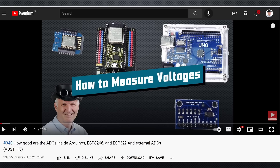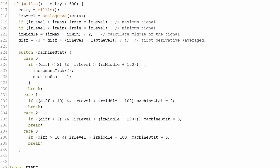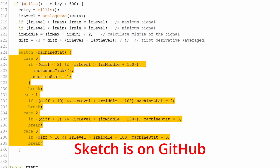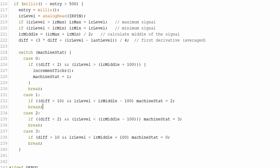We need a reliable signal. From video number 340, we know that the analog input of the ESP32 is noisy, and a reflection also might differ from time to time. This is why I divide the curve into four parts. Zero is where the first derivative and the reading are positive. One is where the reading is still positive but the first derivative is negative. Two is where both are negative. And three is where the derivative is positive and the reading is still negative. Then everything starts over and we know for sure that we detected an entire cycle, so we can add a water tick. I use a state machine that switches between the four phases — this is the most readable way of dealing with complex structures, much easier than a ton of if-then-else statements.